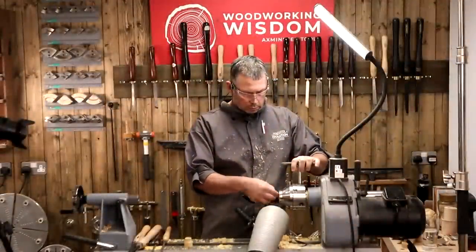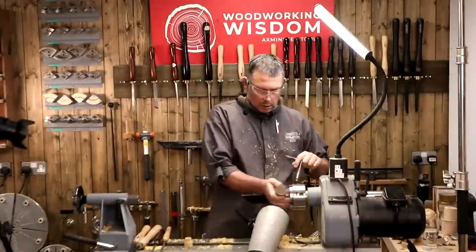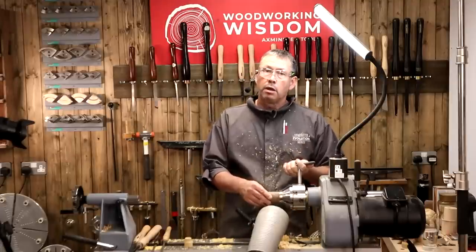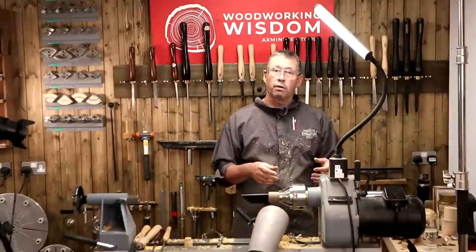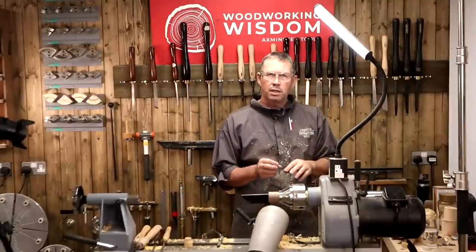And then from Frederick, he's asking, as the wood expands due to heat and etcetera, what allowances do you make for the thread? Well, we don't make any allowances. If you know that you're going to get expansion contraction on the thread, then you need a rough turn at first. Let everything dry out and then cut your threads and choose wisely in terms of your timbers.